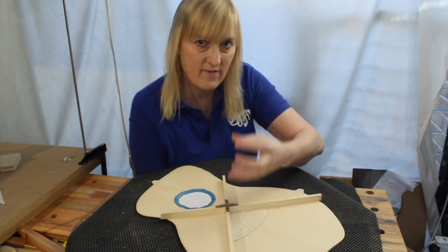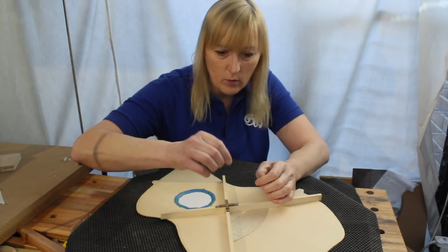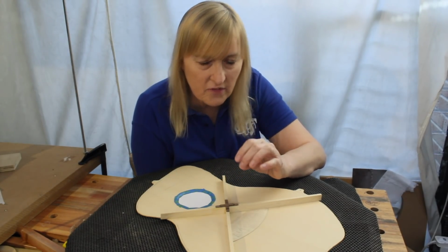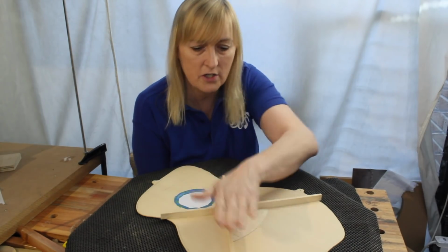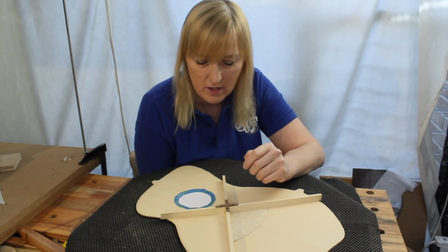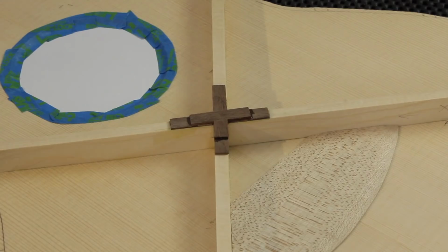Imagine a large heavy weight on the end of a spring bouncing up and down, and then a small little weight sort of vibrating: less weight, higher frequency. The stiffness will come down a little bit, but not too much, because the height of the braces will be maintained, and the height really is what gives us the stiffness. So let's get the chisels and planes out.